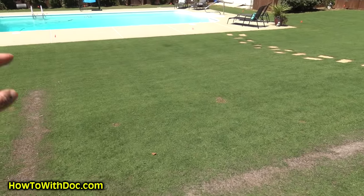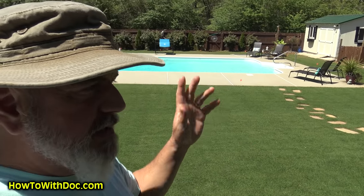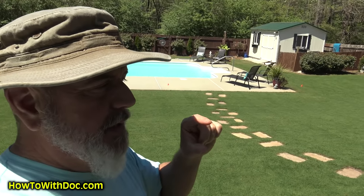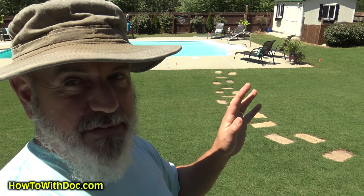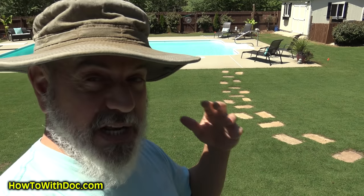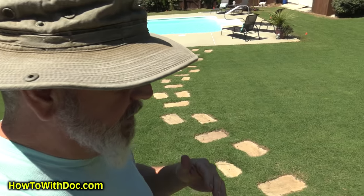We still have quite a bit more to go — there are some ruts down there to do as well. I have learned that if you're going to level a quarter to half an inch, you can use plain sand or a leveling mix — use whatever you want. But when you start to get deep, you've got to make this kind of mixture. I like to pat it down, then the night after I'll do a light mist on it. Try to do this when you won't have rain for about four or five days so the grass can grow up through it. If you get heavy rains you will get some movement, so be prepared to adjust — but just come back and fix it.